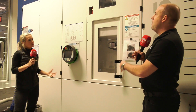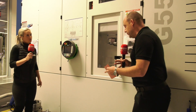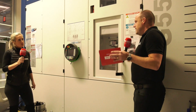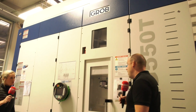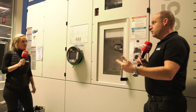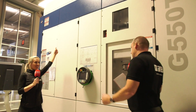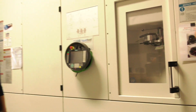The great thing about the GROB machine is that all the accessories are enclosed. There's nothing overhanging — it is essentially a rectangle and everything is within the four walls of the machine. The tool changer is actually housed inside the machine: 72 tools, double disc, one on top of the other. When you're loading the tools you do it through this door here.